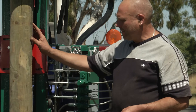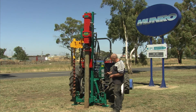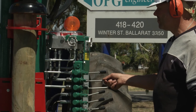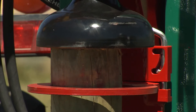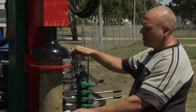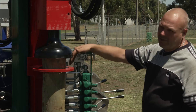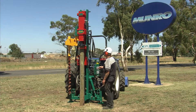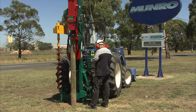When we start hammering, if the post starts to skew off in one direction or the other, we can use the tilt controls to keep the post level. When we lower the hammer down onto the post using the auger feed control, that will start to put the anvil up into the hammer. Once all the weight is down onto the post, close the auger control completely off, and then use the hammer function. It will put downwards pressure on top of the post, and it may actually start to push the post into the ground before it starts hammering.